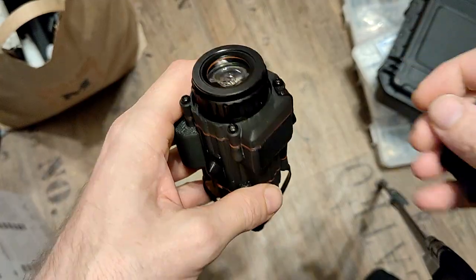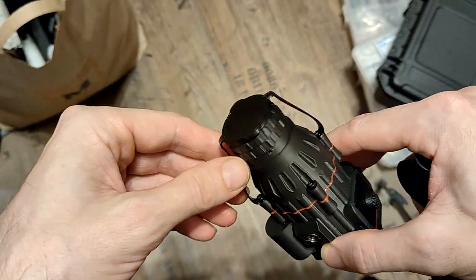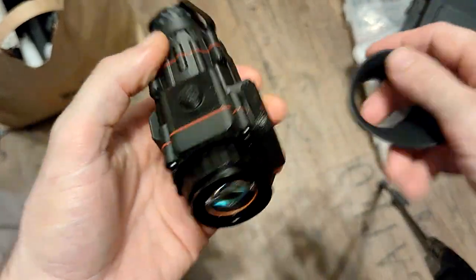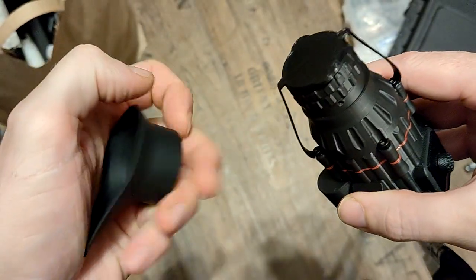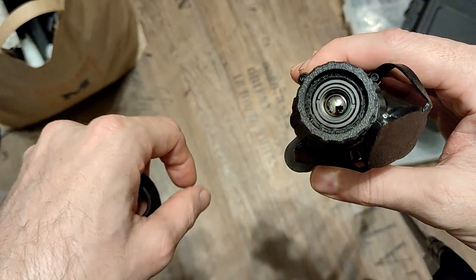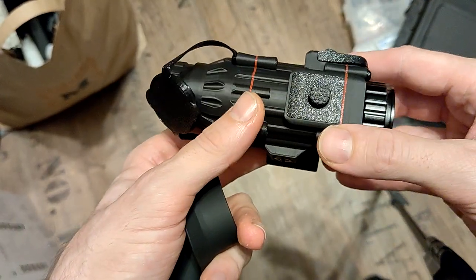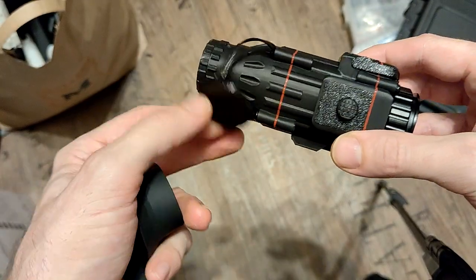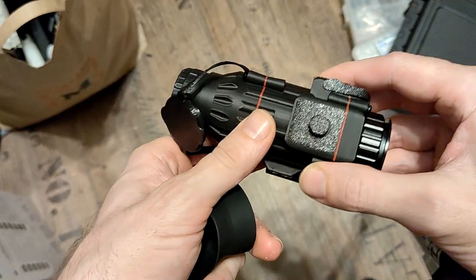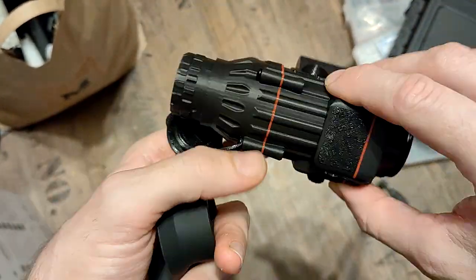On the back we have an NP18 lens. Inside is a 0.39-inch display with driver board, and in this one I went all the way with a 640 core, so this thing can do 640 in all its glory. We have a TPU cover on the front, and this is a 9-millimeter zoom lens. With a 640 core, the 9-millimeter lens is more like a 4-millimeter lens on a 256-core camera, because the resolution is so much higher.